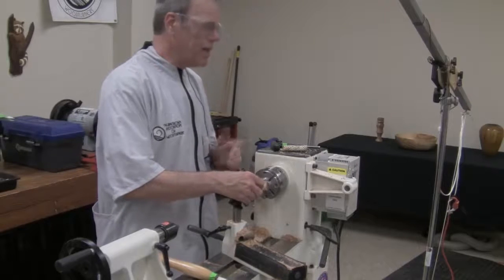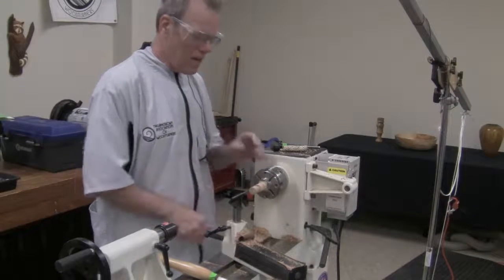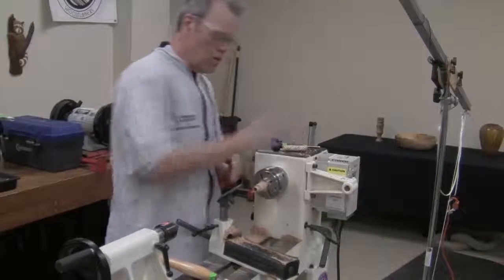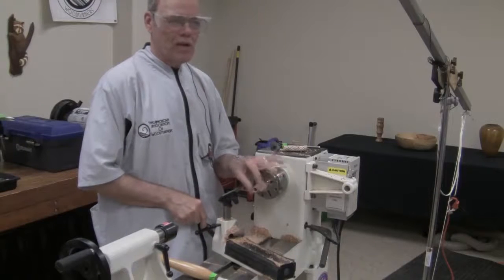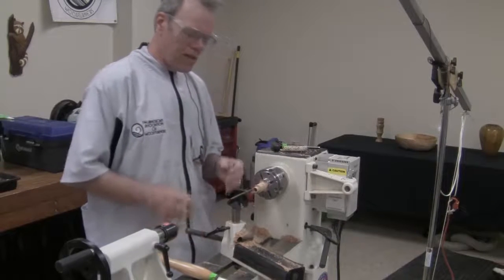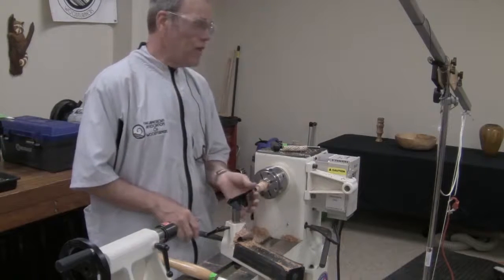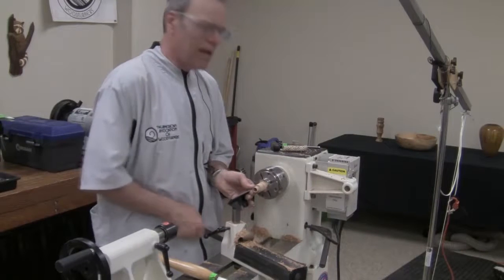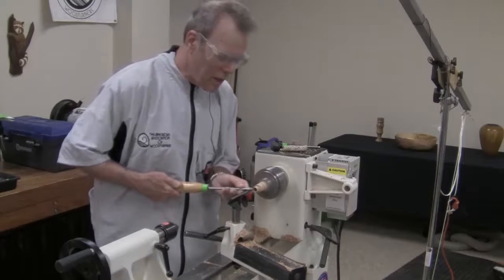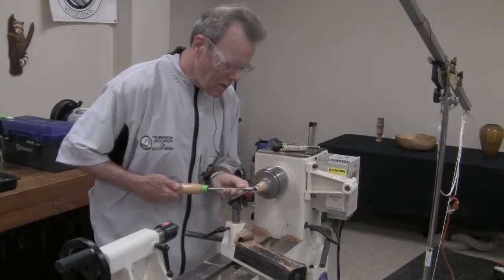If you get one that's late, that when you finish, it's too tight, well, then you've got to resort to sandpaper if it comes off the lathe. If it's a little bit tight, one trick that I found works is you polish it up real good on your Beall buffing system, including the Carnauba wax, and that allows it to slip on pretty well. If it's not quite snug enough, but still close, you can put finish on it, and it might swell the fibers and make it a little bit thicker, and might help. Normally, I don't put finish on box tenons or recesses, but it is a technique you can use if you have to. See if it works for you.